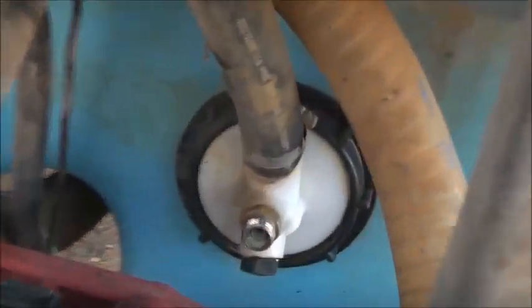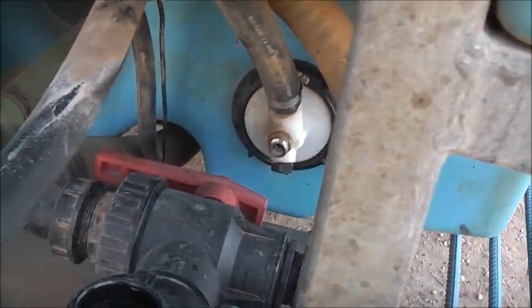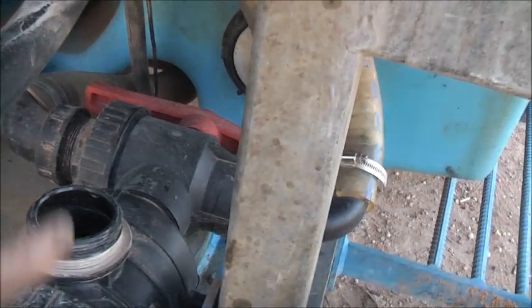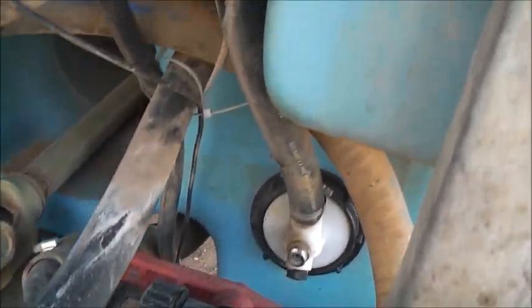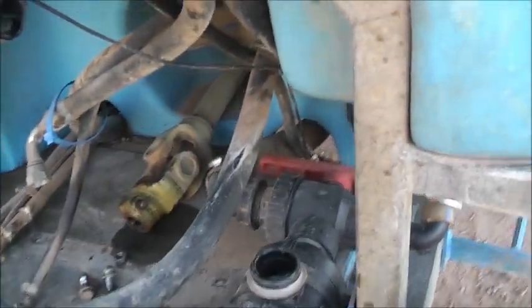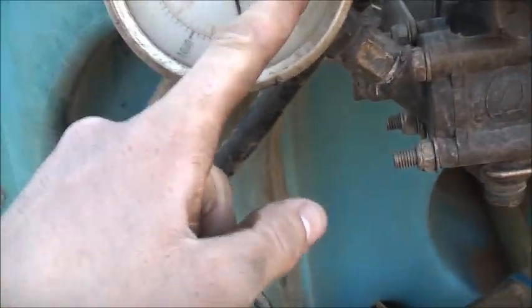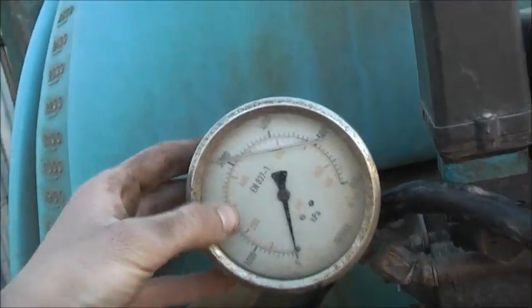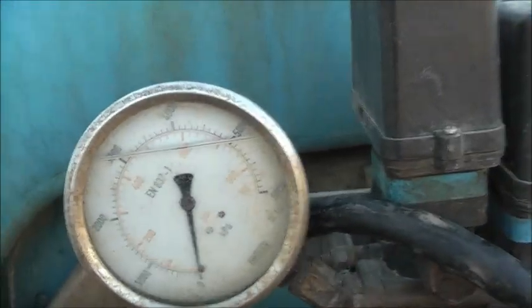And that's actually a Jet Mixer — it's like a pressure washer nozzle. Water cuts through the chemical powder, because some chemicals are powder-based, and that helps dissolve it. The gauge goes up to 860 psi. Normally you go between 200 and 400 psi — that's the typical head pressure on your nozzles on these things.